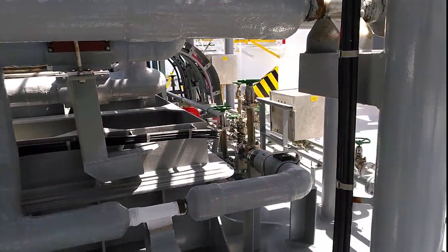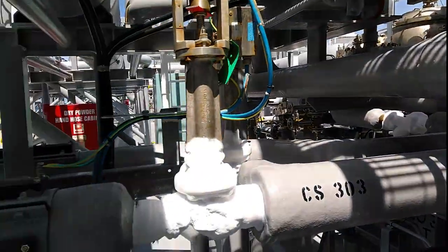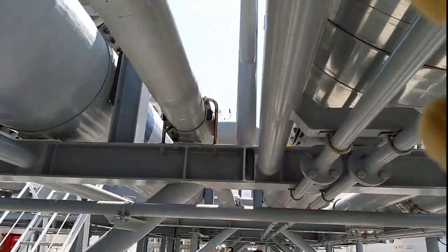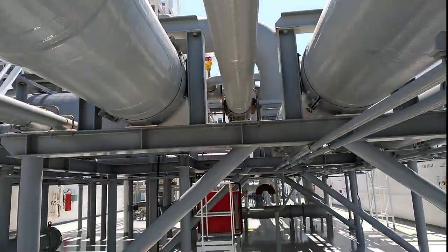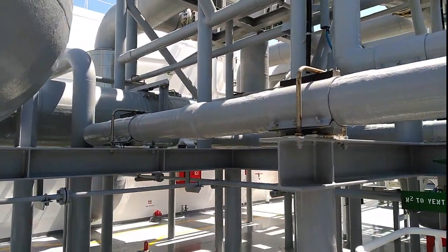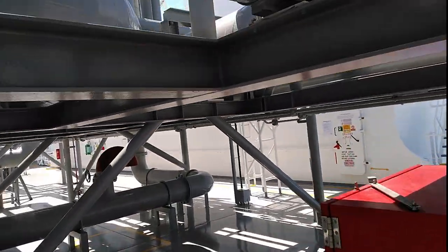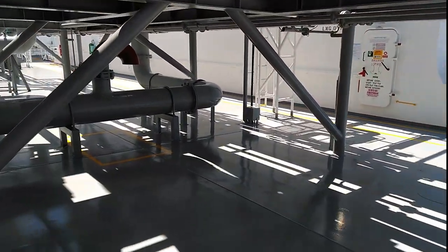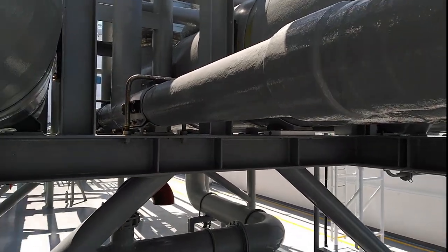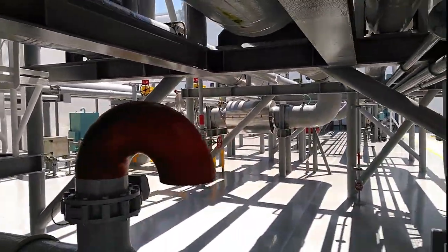There's also a special valve here for emergency use if required. Moving aft — since we are not cooling down cargo tank number three — we will follow the spray line and come across the distribution point, meaning the aft can supply LNG to the forcing vaporizer and to the LNG vaporizer if needed. However, this is not required during this operation.